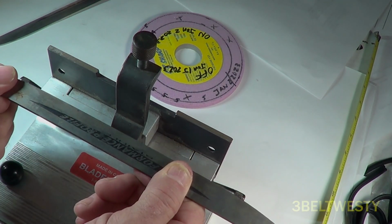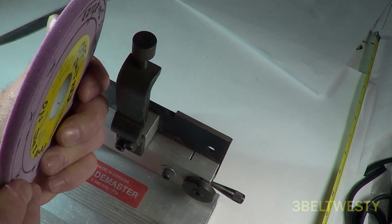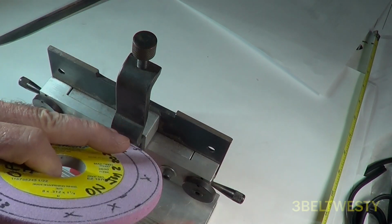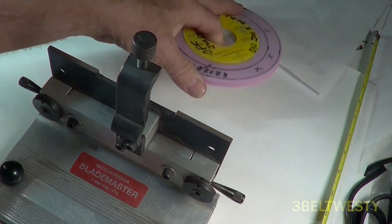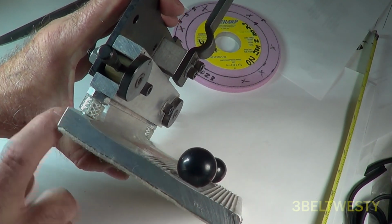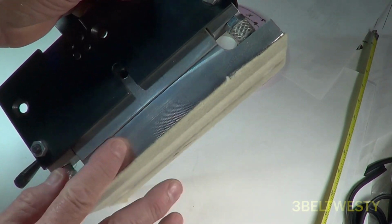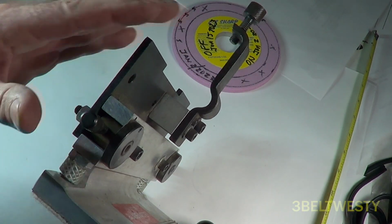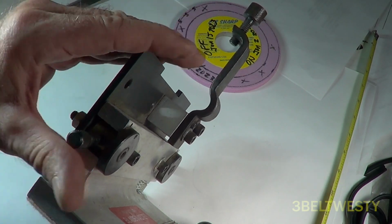You want to completely have this thing to where it's hitting the bulge on the grindstone. This is curved this way. That's the radius of curvature, radius of hollow. So on this type of holder, this extrusion here is all the same up to this. The sliding piece is actually the black piece, that is what is moving.